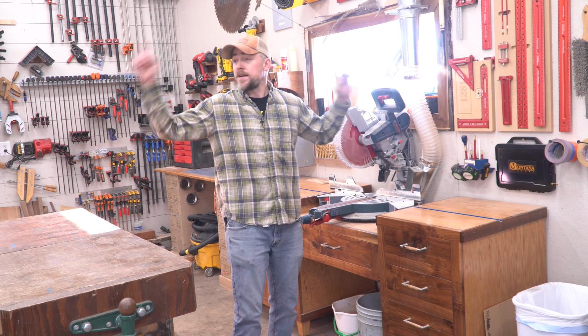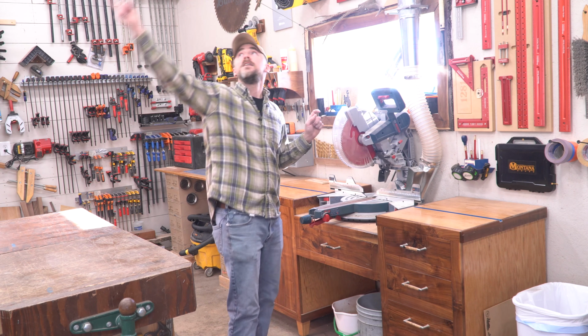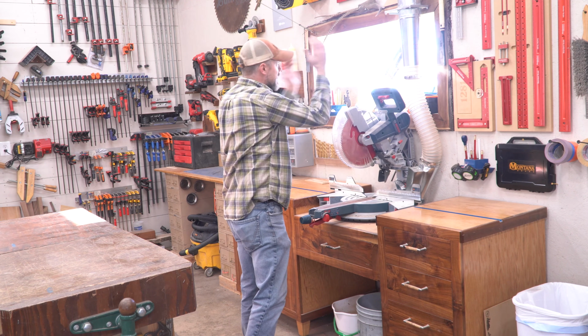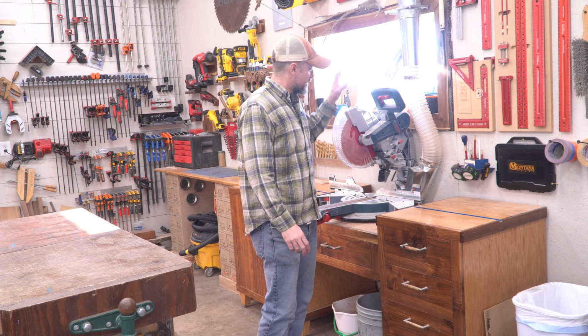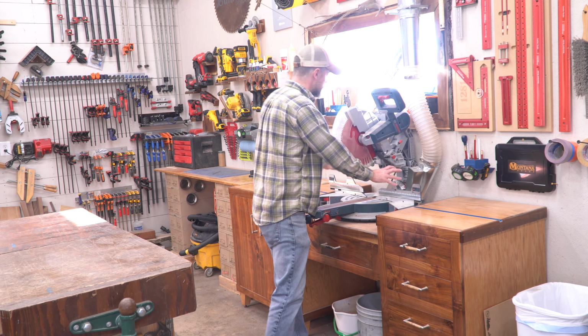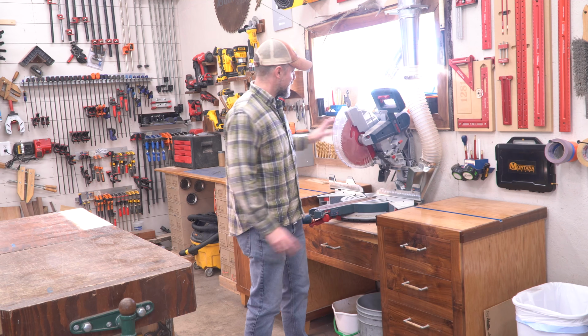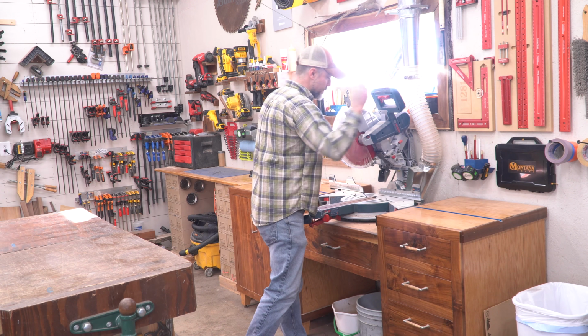The main dust collector is over there. We'll look at that in a second. But the straight line of the whole trunk, the whole main line comes right here and comes down to this thing. And so now I have really good suction right at the tool. Even though it's not really enclosed, there's not a shroud around it, when that's running, this thing doesn't make a lot of dust because it's pulling so hard that everything that comes up gets sucked through and sent away.